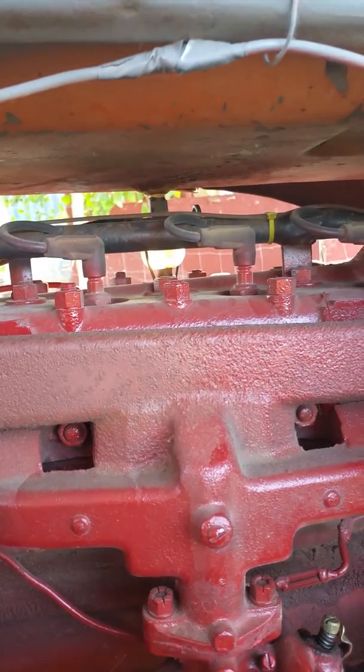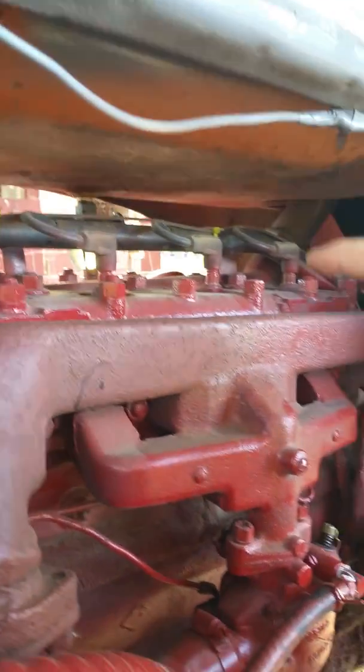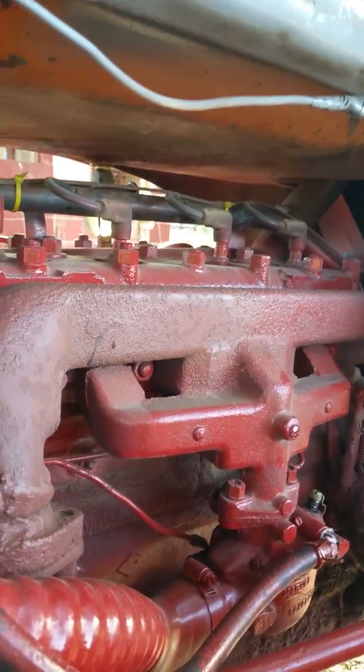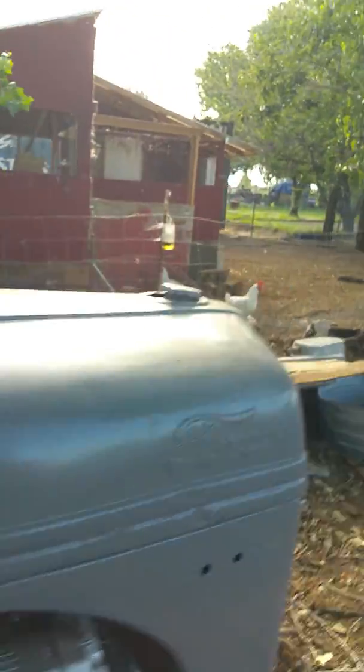Never, ever use a rubber hose. If you have a tractor with a rubber hose, that metal piece of 1/4-inch fuel line is going to cost you a grand total of $23. Or you can spend about $20 on a tubing bender at Harbor Freight and have the same thing made by yourself.